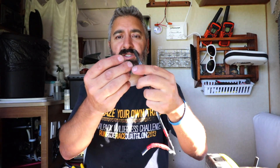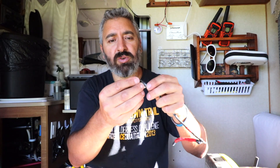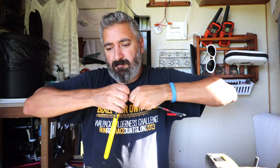Here's another thing nobody explained to me. Some videos say cut the cable this much, so I figured I'd fill the whole metal piece with cable and stripped a lot. But when I looked closely at the metal piece, there are a few indentations showing exactly how far the wire should go in. You just measure the wire to reach that point, insert it to that mark, then get your crimping tool and crimp it. That's the correct strip length — only as far as the indentation mark.